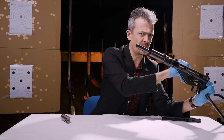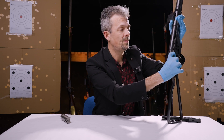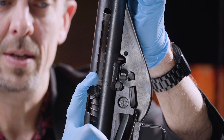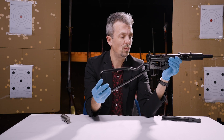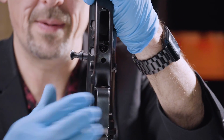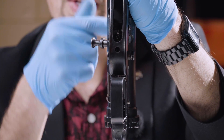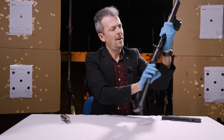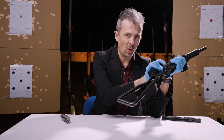Because it needs to be a strong spring and a heavy bolt to keep that gun shut for as long as necessary, it then comes back and stops, reasserts a little bit, and then stops. What's it stopping on? Well, we're on automatic mode. This is our fire selector marked A for automatic. Semi-automatic, automatic — or R for repetition on the Sten gun and on most British firearms. There's no S because the safety is not part of that system.